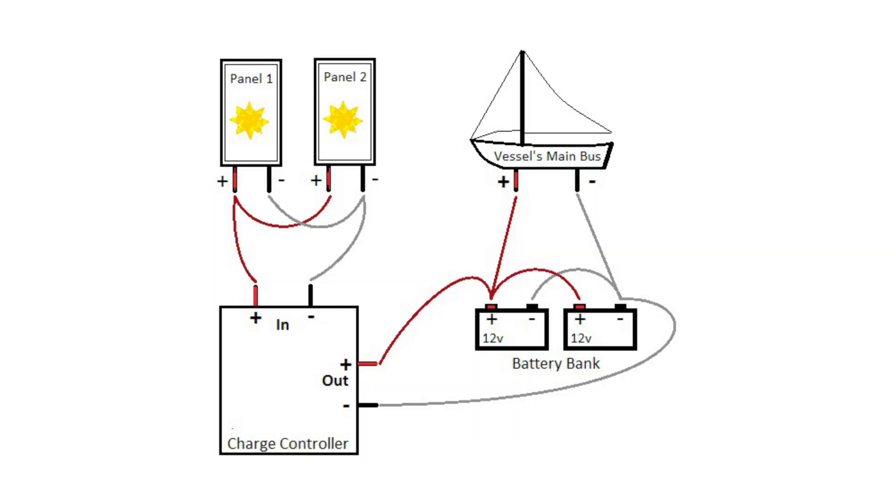The first thing is, let's remember how a solar panel interconnects to your batteries. You're going to have a solar panel, a dedicated controller, and then a battery connected via fuse. You've got the solar panel connected to a controller — either PWM or MPPT — and then that controller, which converts the voltage from the panel either up or down depending on the size of the panel, connected via a fuse directly to the battery. That's how it should be wired.